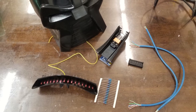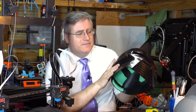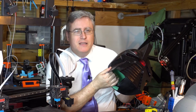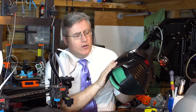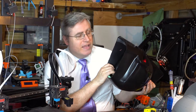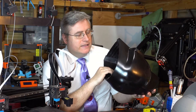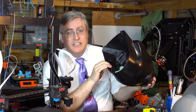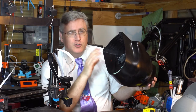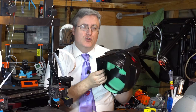That LED mount slips over the inside. As I was doing this, I only did four walls and ran into so many problems — it cracks, it doesn't have the pressure, and sometimes if the layers don't hold super well they split and delaminate. I've had to constantly deal with that. If I were doing this again, I might put more shells on it — maybe up to six shells — or keep it thin at two to four shells if you're confident in your printer, and then use some two-part resin poured on the inside to create the support.